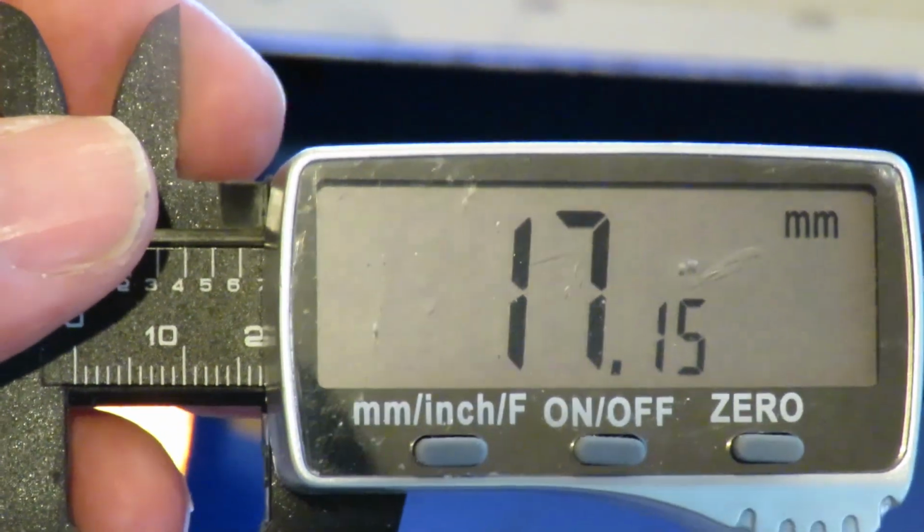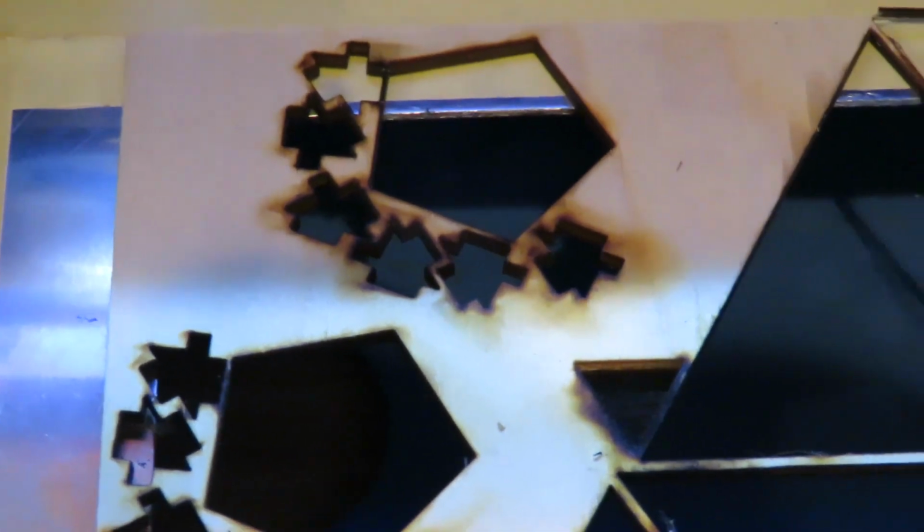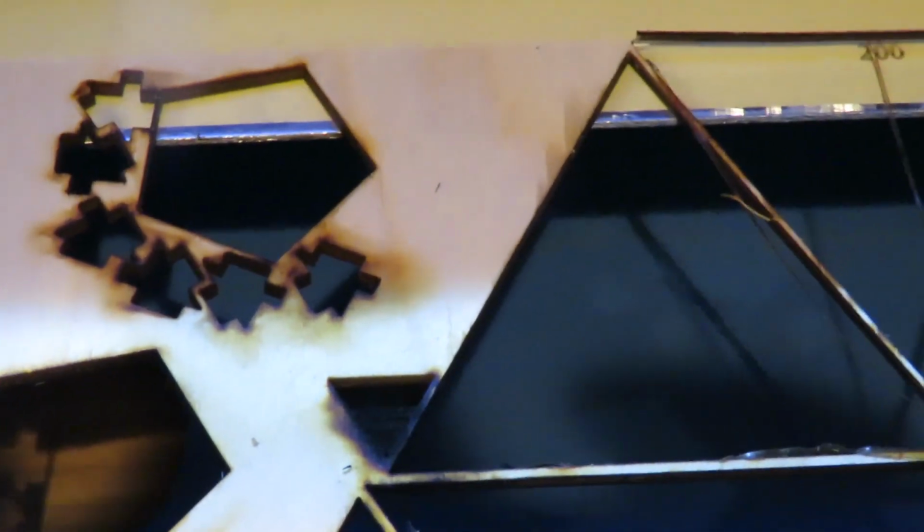In Inkscape, if you ensure that your drawing or figure is offset from the top left corner by 48 millimeters to the right and 18 millimeters down, you will always place your cutter head within the bed opening. When you cut objects through, your piece would suffer less smoke damage where there is no backing in place of the cut. And you can align your pieces precisely within this open area.